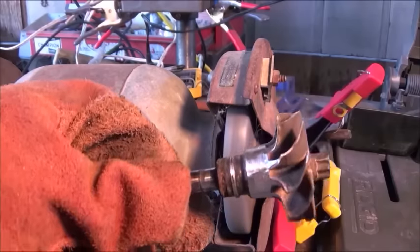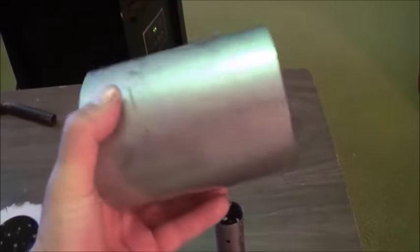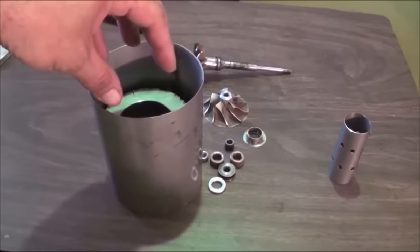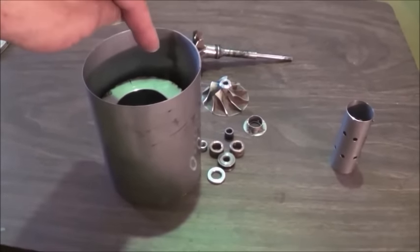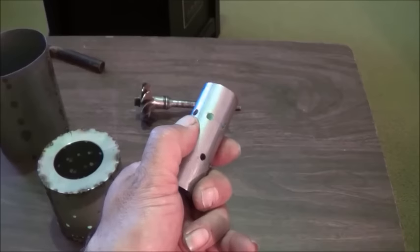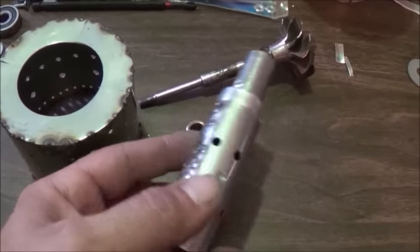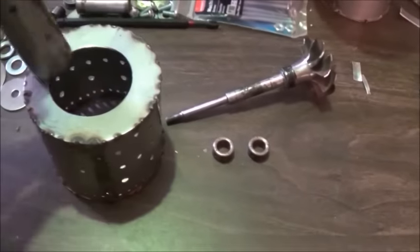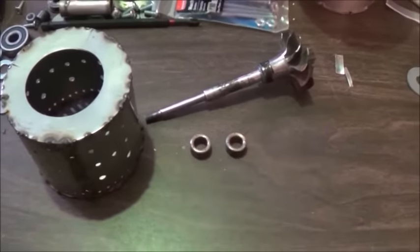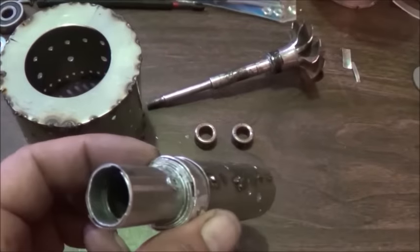You can see how far up I've brought those paddles. This is the outer wall of the burn chamber — it's going to slide over our burn chamber, allowing air to come from our compressor fan down into the air gap between the two walls. I also have a smaller inner piece — a one inch tube — with quarter inch drill bit holes spaced about an inch apart. Right now I'm building the piece that holds our bushings in place inside the center of the engine, which holds the bushings for our drive shaft so the compressor fan and drive fan are in line down the center of the engine.